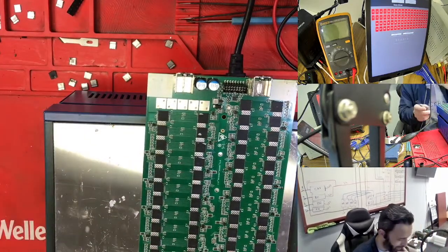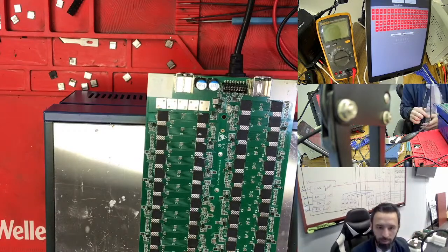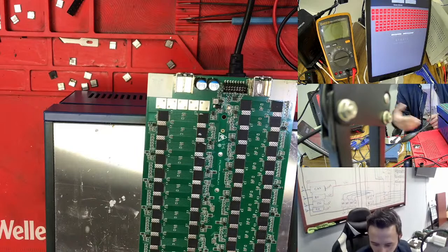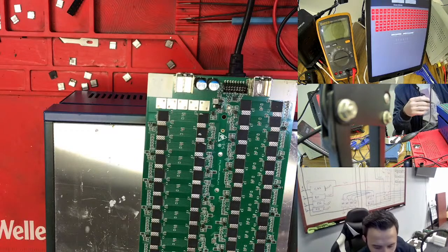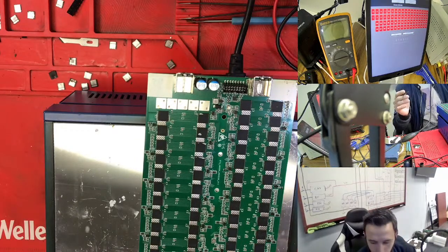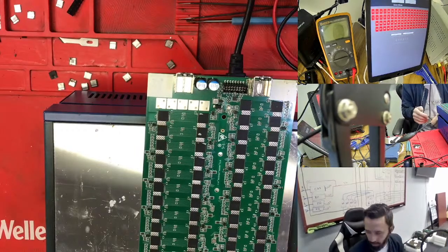One thing is this one; another thing is how you can make it easy to fix. The easy thing I see with StrongU is that the chip gives you some number. For example, it gave you 25, and it says 26 is not working. So you just replace 26, take it out, clean it, and put it back, and it works 100%.